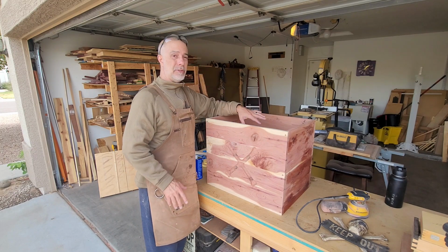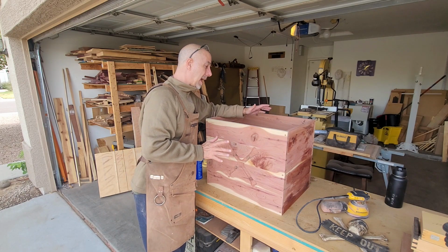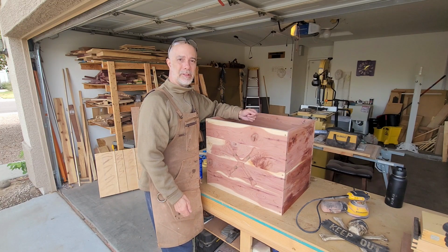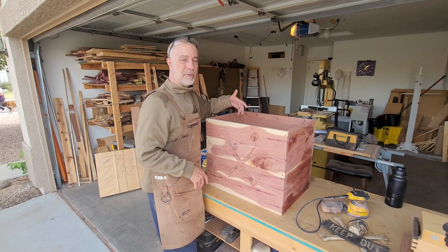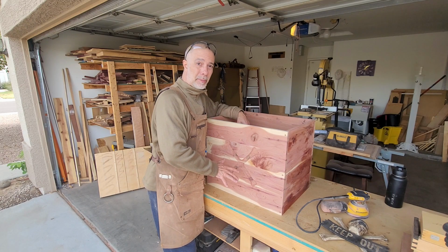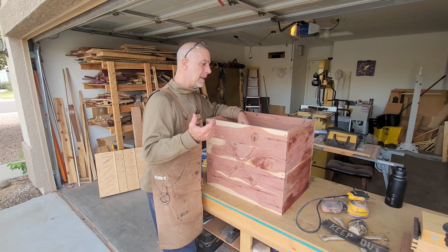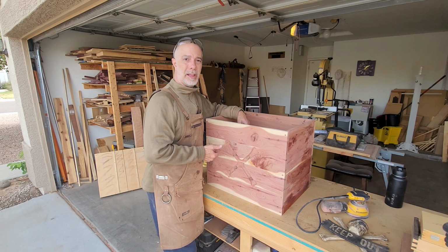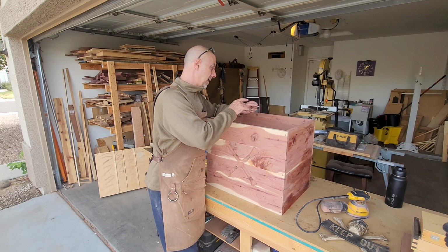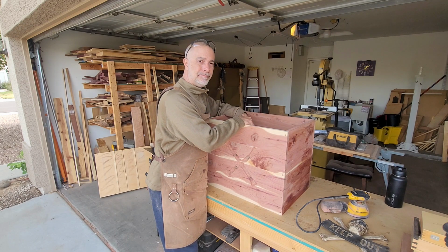And then the other thing is, if you decided to use MDF, make sure that you tape down the bottom of it. I've had bad experiences with MDF. I use it on the top of my work surface because I don't care about it, so I can remove it anytime and put a new sheet down. But what I have noticed is whenever it gets wet, it'll bubble up because it's not normal wood. I mean it is, but it isn't, right? So I would not take the chance with polyurethane. I would cover the whole bottom with a sheet of plastic and tape, and then use the polyurethane on the inside of it, and try not to get it on the bottom.